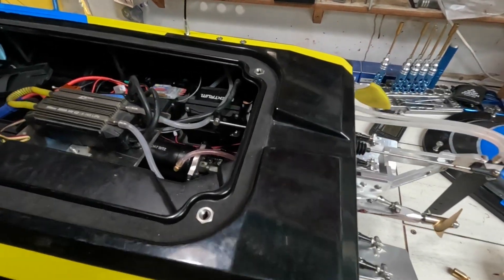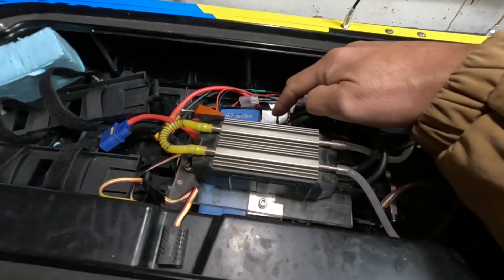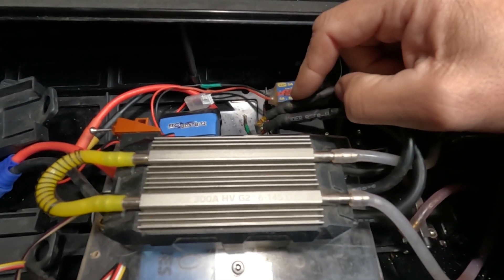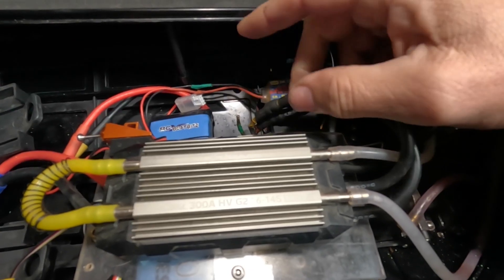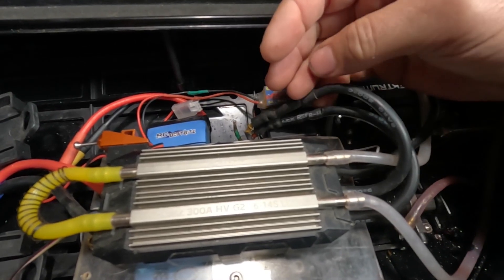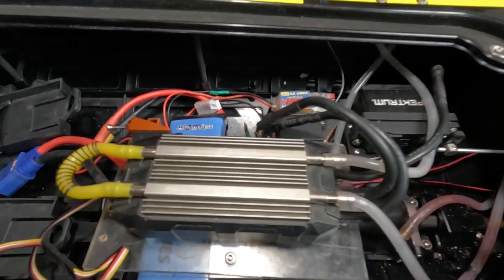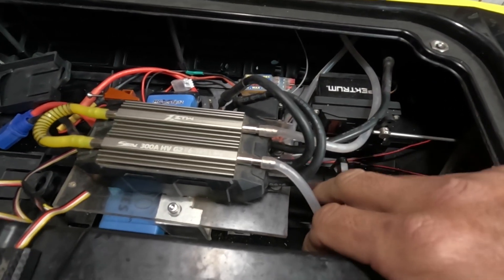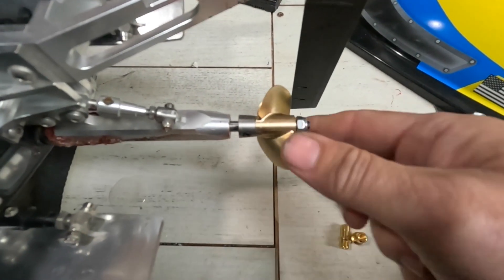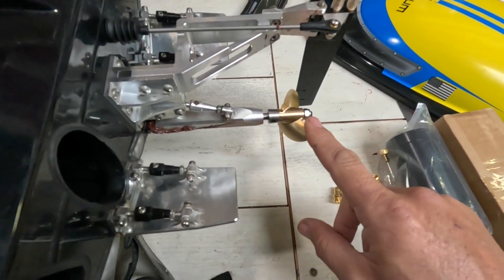All right, I got the Supersonic Weight on the bench. Took her out yesterday and desoldered one of the motor terminals — was only running 5.5 or 6mm terminals, should have been running 8mm. It was just what I had on the motor, pulled from a drawer so I didn't bother changing them. The motor was getting boiling hot. I was running the smallest possible prop I've got with a quarter-inch shaft — a 5514. I've got 5214s on their way, here next week.